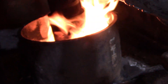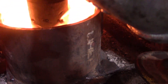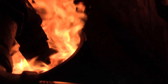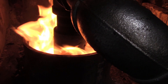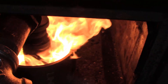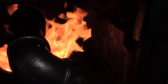I made these holes not perfectly round so everything does some different stuff. As you see, the air itself doesn't do the burn — it's at the very edges where the oil vapor and the air hit. I've got just enough oil introduced so when these jets spray straight out you'll get a good mix. If you look down low, there's just a slight tinge of blue down at the base, so that's great. It's sitting uneven right now so oil tends to pool on one side, which is why you're getting a larger flame over there.